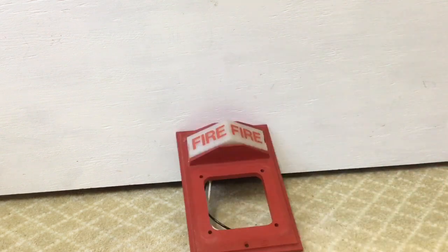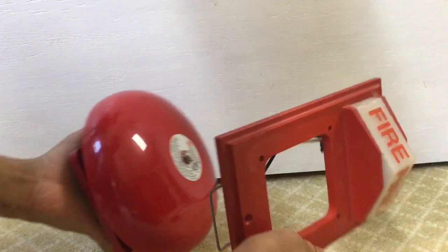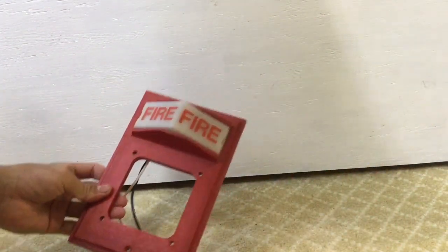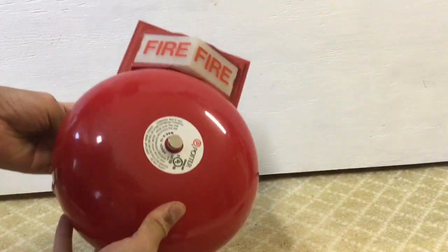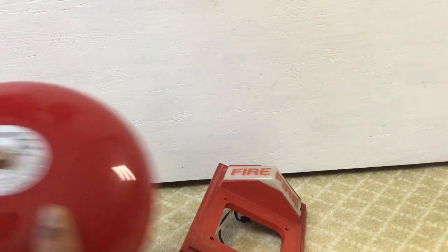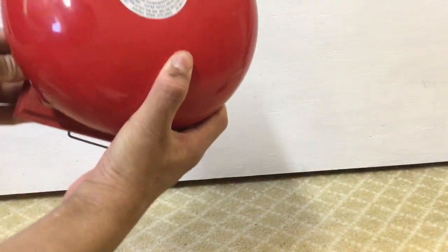However, if I take a large bell and try to slap it behind the device, that's not going to work. So it would have to be mounted on the front of the unit. Something you might also wonder is how the bell is going to work — most bells have warnings on the back saying you should mount the bell upright because the striker that hits the gong needs to work with gravity instead of against it. So it has to be mounted like that, but that would cover the light.